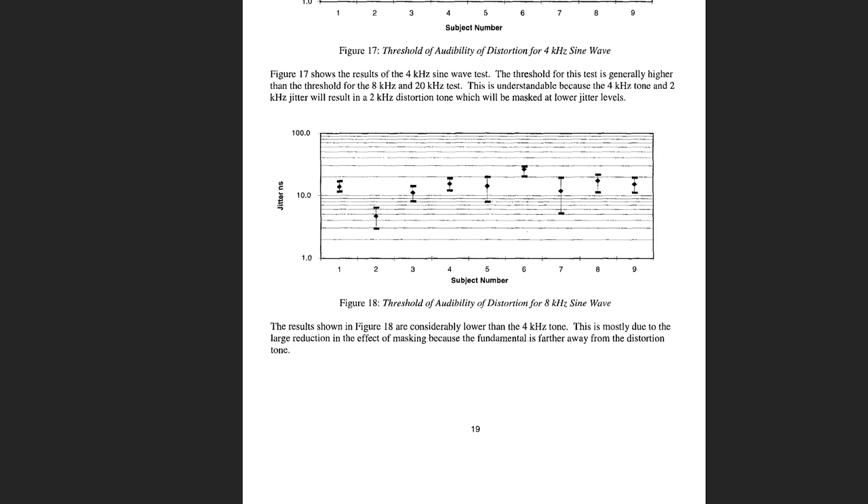I'm not going to be talking about subjective sound in this video for a few reasons. Firstly, the audible effects of jitter and the audibility threshold for jitter has had relatively little study done into it, with the main one being back in 1998. This study puts the audibility threshold generally around 2 to 10 nanoseconds depending on content — the jitter at the output of the ZenStream is over 10 times lower than this. I'd encourage you to read it; there's a link in the description. I'd also be keen to see more testing done with modern DACs and a wider selection of test subjects. Not to mention, there are different types, frequencies, and structures of jitter which probably have different audible effects and audibility thresholds, in a similar way to different types and orders of harmonic distortion. Also, a device like this is going to have different effects in different chains — some setups might see a real improvement from a ZenStream, some might see none at all, depending on how noisy your current source is and how well your DAC filters out noise and reduces jitter.